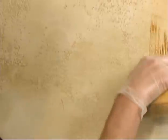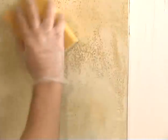After the green layer, you can leave it as is if you like, or you can add a darker yellow-brown Velature layer and continue to build up the darker colors. If you start with too dark of a color on the first coat, you'll stain the wall and it will become spotty. For a dark glaze finish, always start with the light coat first and then add the darker glaze as you want, building the darker stains as you go.